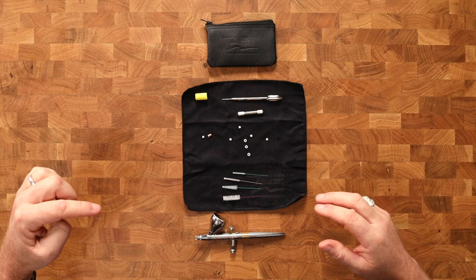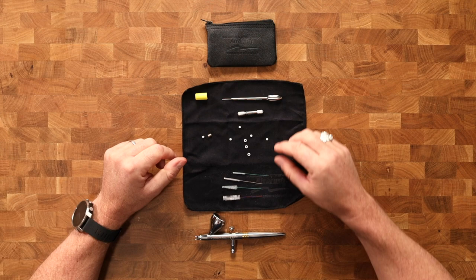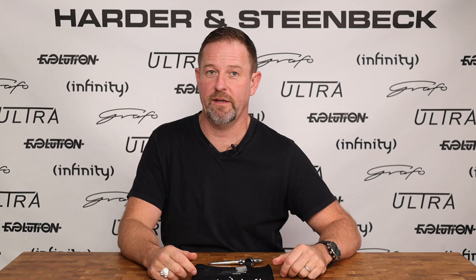If you're seeing bubbling in the paint cup coming from the front side, then it's more than likely your nozzle seal — we'll come back to that. In our experience, you almost never need to adjust your needle packing. They're made from a material that's extremely stable under all kinds of chemical attack. You don't need to remove them to clean your airbrush, and it's extremely rare that you'd ever need to adjust it. They can go for years without ever needing adjustment.